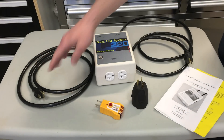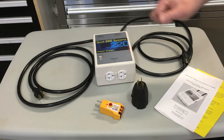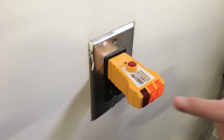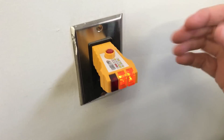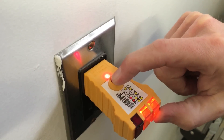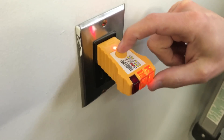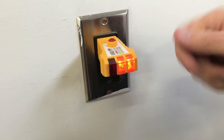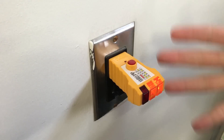You go around and plug these into different outlets, and when this light lights up, you're good to go. Use the tester: plug it in, and if these two orange or amber lights are on, the receptacle is wired correctly. Then press the red button on top. In this case it gives a red light, telling me it's not a GFCI receptacle, which is good — the power is still on. If it were a GFCI outlet, pressing the button would kill power and you wouldn't be able to use it.